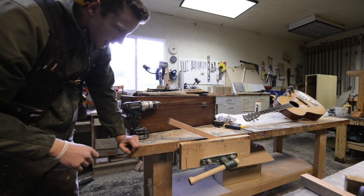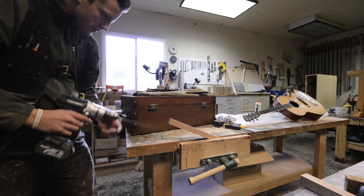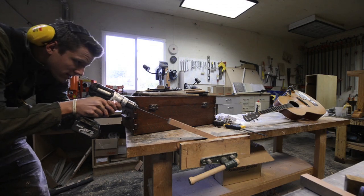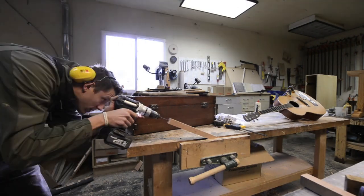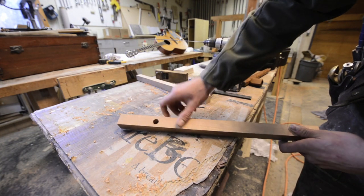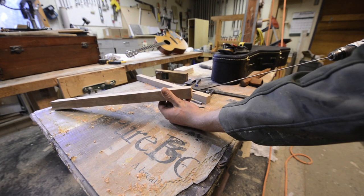My first attempt was not a success — if that gives you any encouragement. The grain is moving a little bit along this wood; it's got a twist in it, so hopefully that won't run my bit too far off. I'll try this one straight. Drilled my end hole, went down to the five-eighths forstner, met the hole — turned out to be a little bit to the side, but it still works great. Ran the drill bit through three or four more times to clean out the hole.